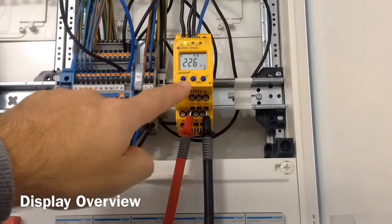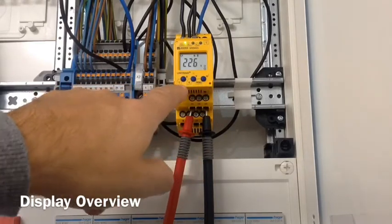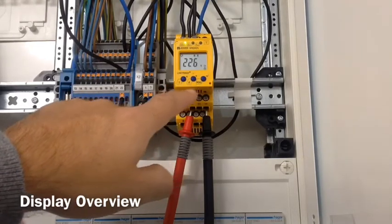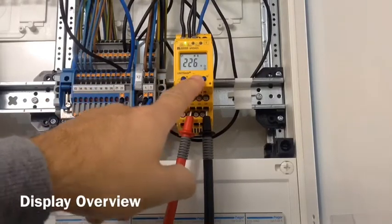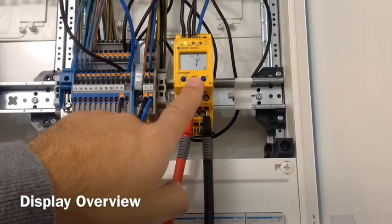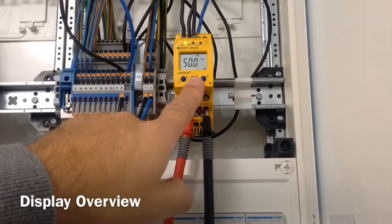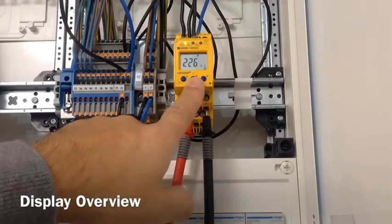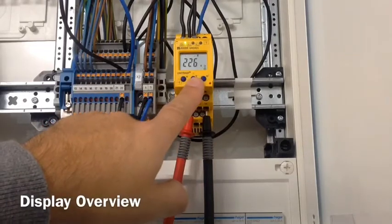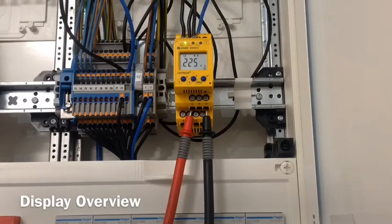You can scroll up and down the menu with these two buttons — up and down. This is the enter, or go-into-the-menu button. This one acts as a test button if you hold it for a second and a half, and this one is a reset, again for one and a half seconds. Using these two arrows we can scroll through the menu. Here you can see the voltage from L2 to neutral, L3 to neutral; we can check the asymmetrical value real-time, look at the hertz real-time, and see the phase rotation. Any of these values you can make a default display by just pressing enter.